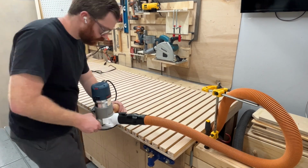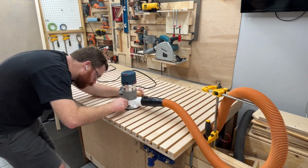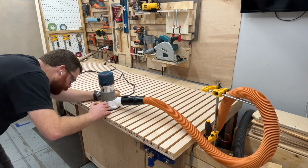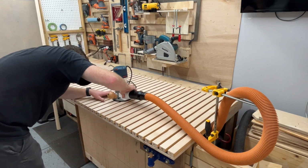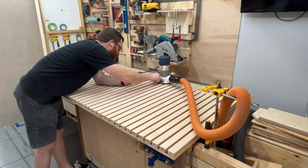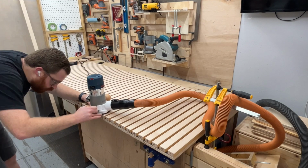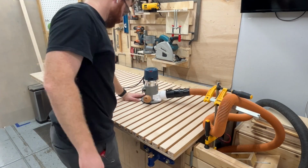And again, you want to make sure that cords and your vacuum hose do not hit the edge of those edge bands improperly, or else it could rip it up. Again, once we have it properly chamfered, we won't have to worry about it. So then the next pass that I did was with a chamfer bit, so that the edges were not sharp and nothing could grab them.